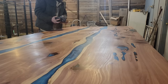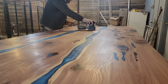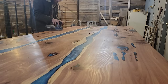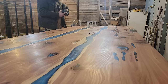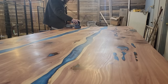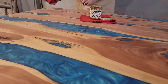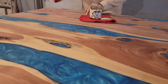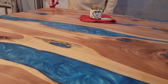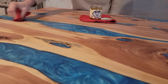So they said there wasn't a need to sand, but like I said, I wasn't happy with the finish anyway, so I decided to sand. And sanding wood already treated with Odie's oil, even a week after the fact, is very difficult because it gums up the sanding pads so quickly, which is why you can see in this shot, I just have one of those rubber sandpaper cleaners permanently on me. So now I've progressed through all the sanding again, and instead of stopping at 400, I went all the way up to 800.